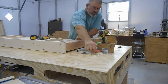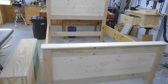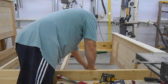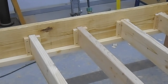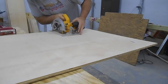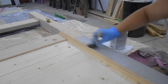Then I mounted the hardware to the headboard and the opposing hardware to the rails. Since it's a spare bed we didn't put a mattress in it, so I framed the bottom with two-by-sixes and put cleats across the bottom to hold them up, then another little cleat at the end of each one to keep the two-by-six from ever turning over. Then I just made a little socket for it and cut down some half-inch plywood to cover that.